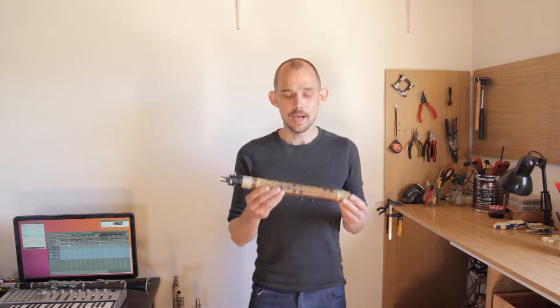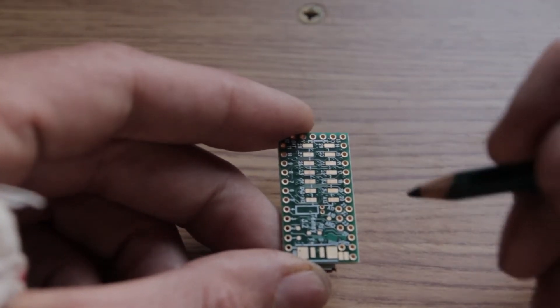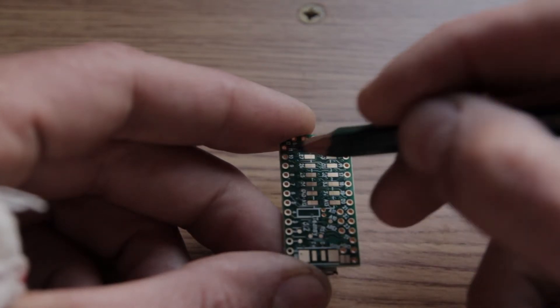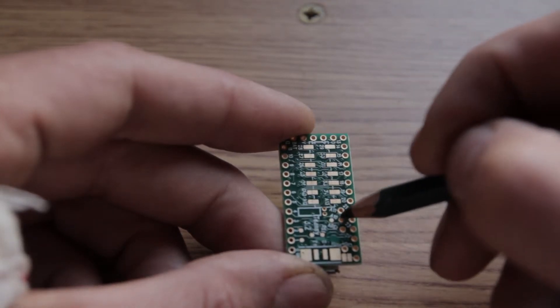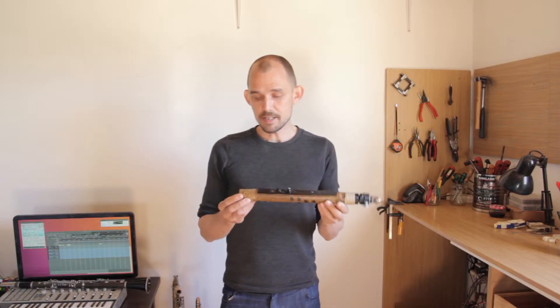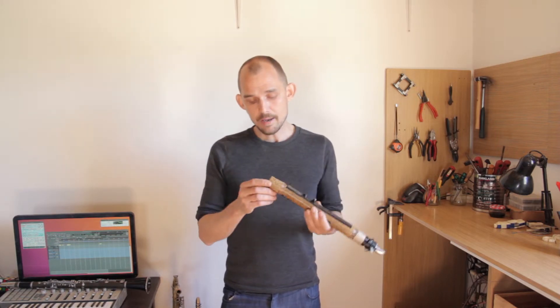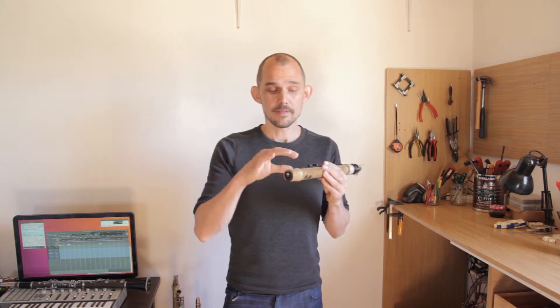Even with the multitude of sensors on the OpenHorn, I'm still using only the most easily accessible pins on the microcontroller itself, leaving the solder pads and less accessible pins for future expansions. The micro-USB plug on the Teensy microcontroller is not used in the OpenHorn. Instead, a more sturdy USB-B port is connected via four solder pads on the microcontroller and then made accessible at the base of the horn.